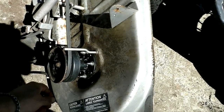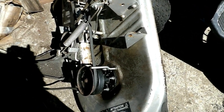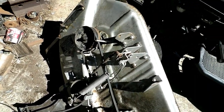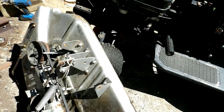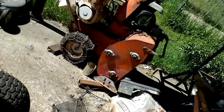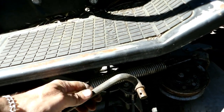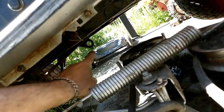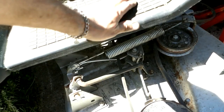I got my nice shiny new-looking blade mount attached. Learned one thing - not all of them are waiting for self-tapping screws, this one wasn't. I'm about ready to put the blades on first and then put it on the mower. The front support bracket goes right off the deck with just another pin. The blade engagement lever on the deck has to be facing towards the front because it hooks in over here - I had it towards the back and you can't rotate it towards the front without sliding the deck back out.